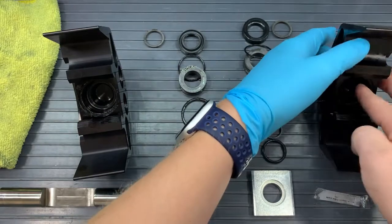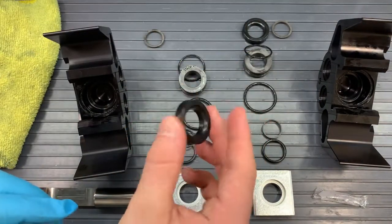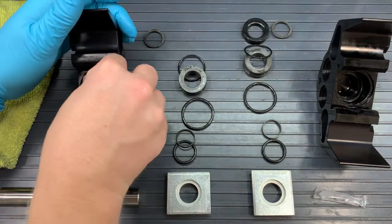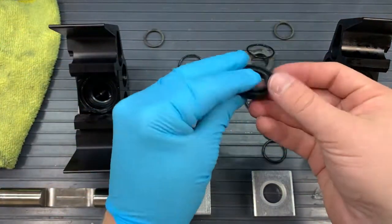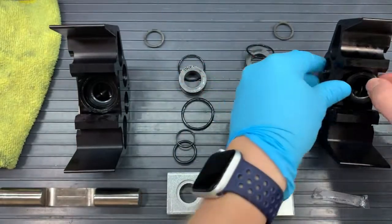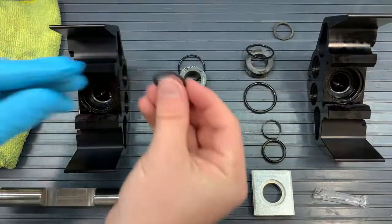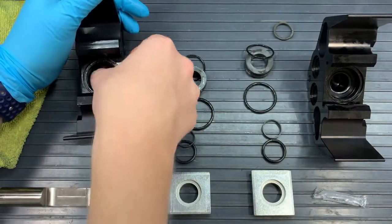head. Next, we will grab the U-cup, and the orientation is important. We want the U edge, so it looks like there's a U going around inside, to be facing into the pump. It might be a little difficult, it could be a little rigid, so you might need to use a little bit of force to get that down in there, so everything else will fit on top of it. And if you put it in there correctly, there should be a little lip on the inside